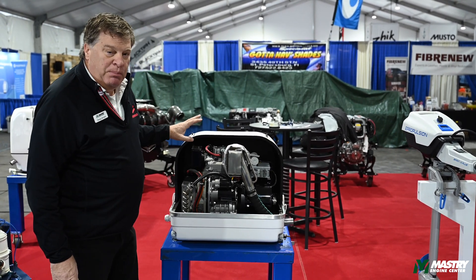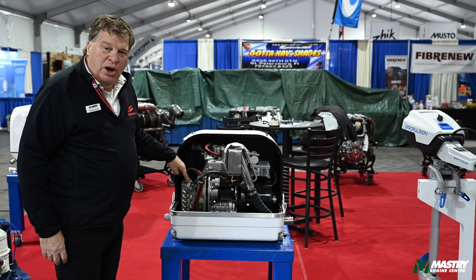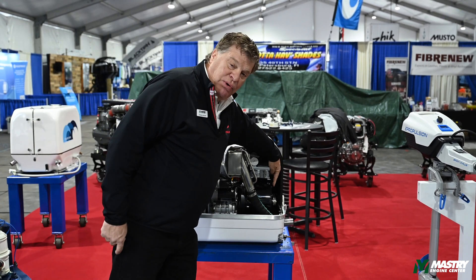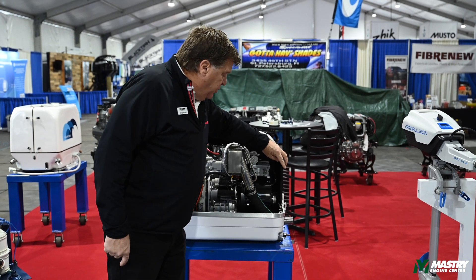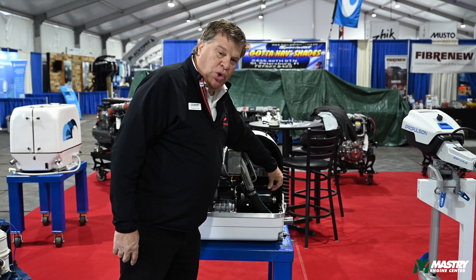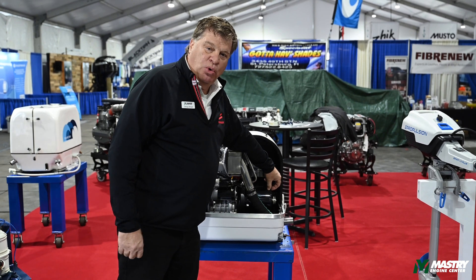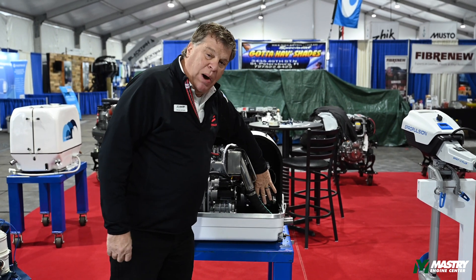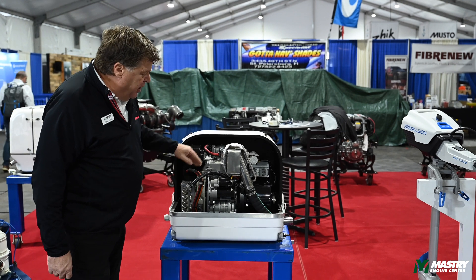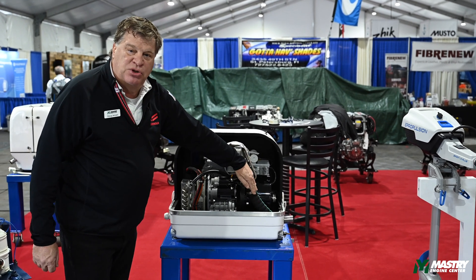What we do to make it a marine engine, we add an air-to-water heat exchanger. We have a water pump mounted on the back — it's a belt-driven water pump. The seawater gets pulled in, cools the alternator in the back. There's a water jacket on here, all stainless steel, that cools the windings on the alternator, goes through the air-to-water heat exchanger, and gets dumped into the stainless steel exhaust system.